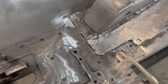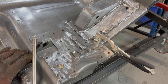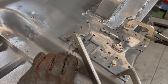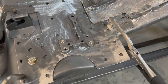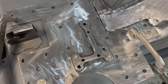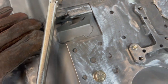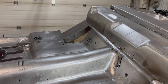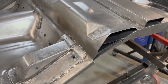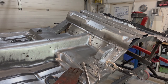Pretty straightforward - no hiccups. I trimmed the doubler plate and things are fitting nicely. I worked the plate a little in the vise to get the angles right, and with a few strategically placed clamps it's fitting nice and snug. I'll clamp down, finish the hardware, drill the remaining holes, cinch it down tight, then plug weld and stitch weld all around - this side will be complete. Rinse and repeat on the passenger side and we're good to go. The only thing remaining is the closeout of the cross members and the floor assembly is ready to be rolled back under the 67. Tune in next time. Cheers.